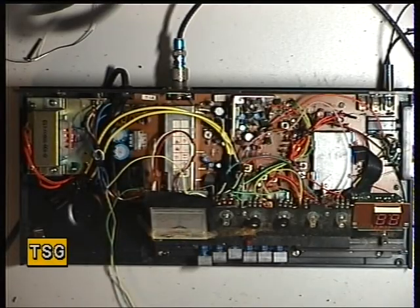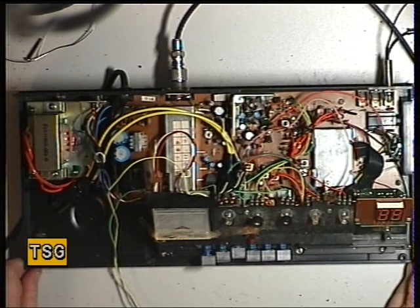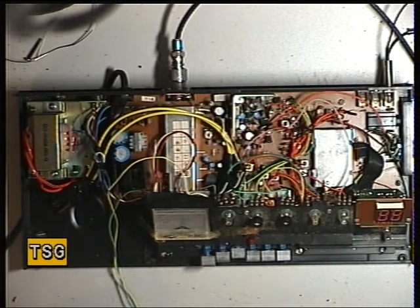That's taken eight screws out and the knobs off and opened it up. Now these were made in Taiwan by the company Great, and so were some of the other Fidelity models. The 1000 used the Great 848 chassis and then there were quite a lot of other radios that used the Great 58 and 868 chassis. It was quite well known for being a bleed-over box, but in these days of much lesser users - it was a problem when there were ten people in one street all trying to chat on different channels with adjacent channel rejection snags on radios.